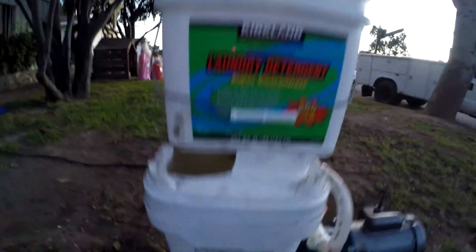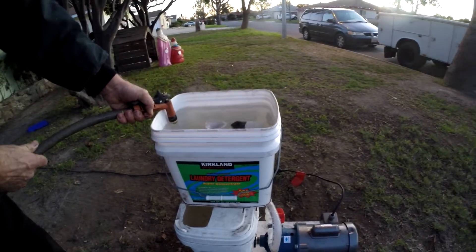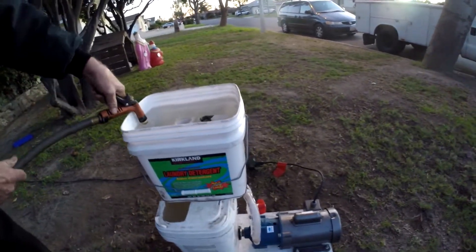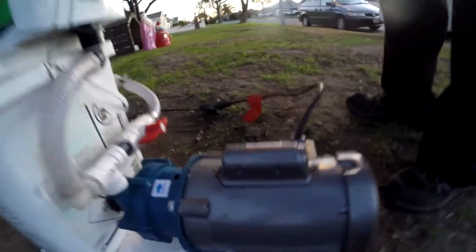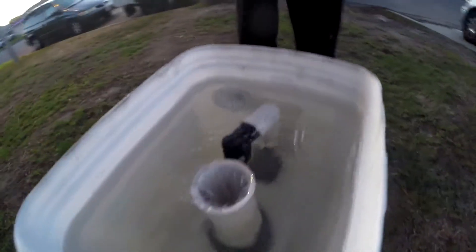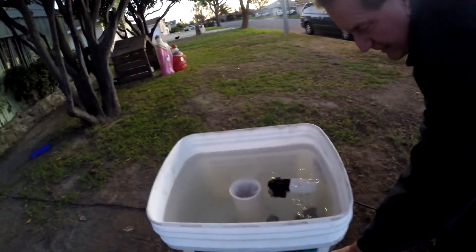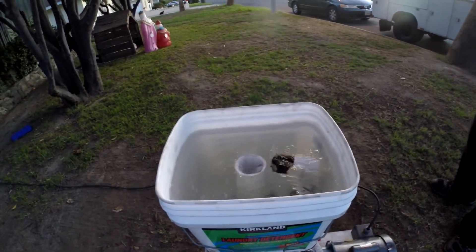You can see how quiet it is now. The actual sump has baffles in it, so the water level won't be at the very top. The standpipe will also be longer in the final setup. The major noise is from the suction and the pump, but the pump is relatively quiet. We'll adjust the standpipe if needed. Let me turn off the bypass so we have the full 12 gallons a minute going to the main tank.